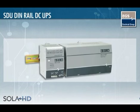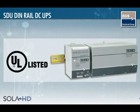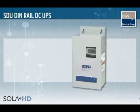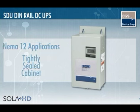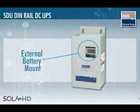The SDU DC UPS is the only DC system that's UL 508 listed for both the power modules and the batteries. That means the system can be mounted inside a cabinet without derating. In installations where cabinet space is limited or the system is in a tightly sealed cabinet, as in most NEMA 12 applications, Sola's external battery module allows you to seal the electronics in the panel and maintain safety by mounting the battery outside of the non-ventilated enclosure.